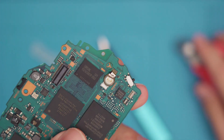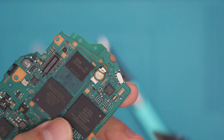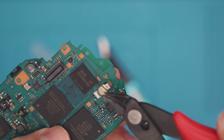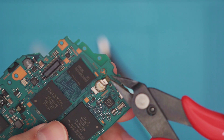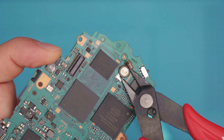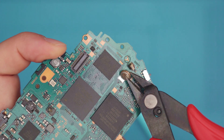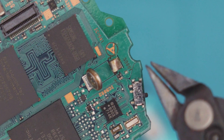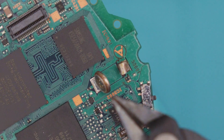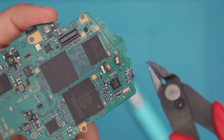At this stage it's very crucial that you take extra, extra care. Because if you go too far — and sometimes even before that — you can accidentally rip the pad. Now it's not the end of the world; I have recovered from that, as the traces are pretty simple on this one. I'm going to leave this one as is and try to fold the actual capacitor forward, just a tiny bit, while pushing inside — we don't want to rip the pad. I recommend you open it up like this before you desolder it, as it will be much easier to transfer heat when these two parts are separated.